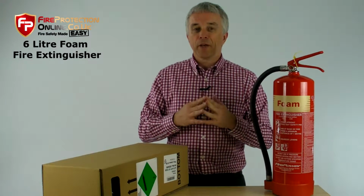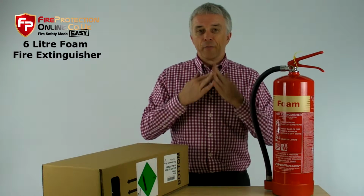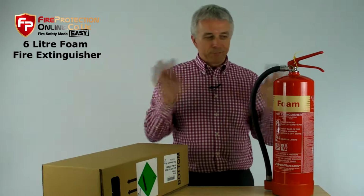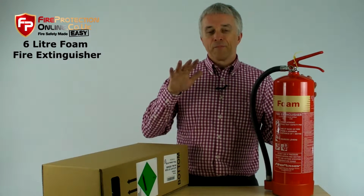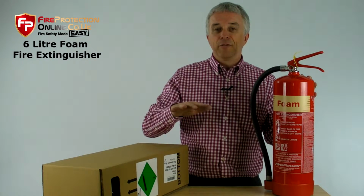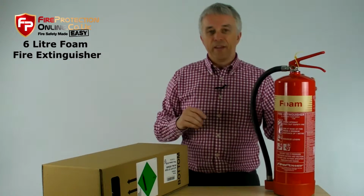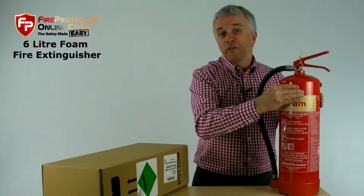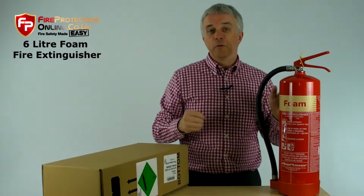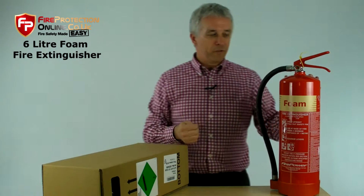So one of the most popular combinations we get, 6 litre foam, 2 kilogram CO2, job done, covers you for about 2,000 square foot, 200 square metres in any premises on any floor, because that covers pretty much any type of fire. And that's why these, plus the fact that they are 2/3 the weight of a 9 litre water, are often more popular than the water extinguishers.